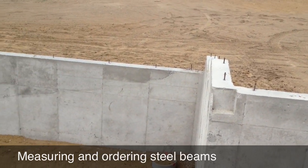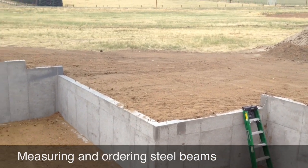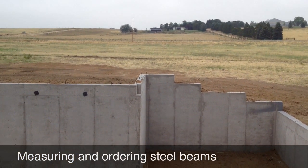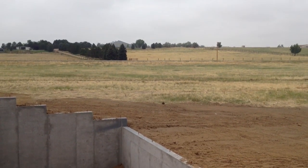There are some places on my foundation here, since I've got this lower end — this is for a garden level. I've got steel beams that will come from this pocket, straight out, and bear on a wood wall at that end.